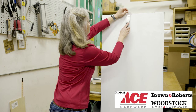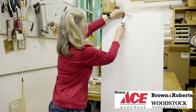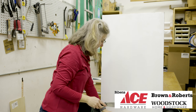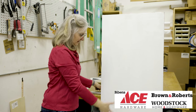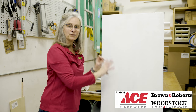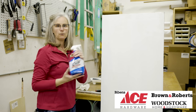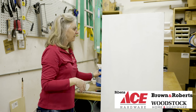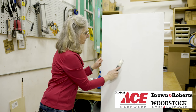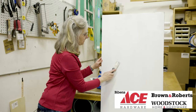We've got a little residue up here, so we're going to take a flat edge — try not to gouge your sheetrock — and just lift that off. If we still had little pieces left, I'd just repeat: wet it with the stripper again, let it sit, and then take the flat edge. I still have some paper on here.